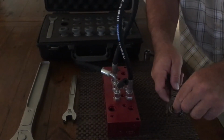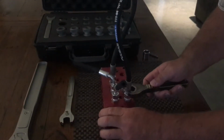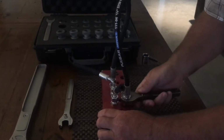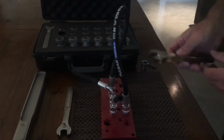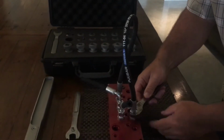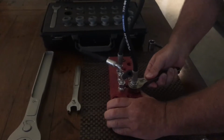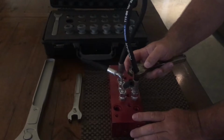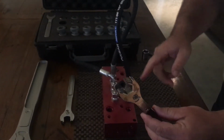With the RotechTools open-ended ratcheting wrench, you put your full open end in, engage one time, stay engaged, ratchet the hose off, free spin it, take it off. If you're tightening it up, once again, you engage one time. Doesn't matter which angle, where you're coming from. Tighten it up. Very easy to disengage. You move the pawl spreader, and with one hand, you can quickly and easily remove the tool from any closed loop system.